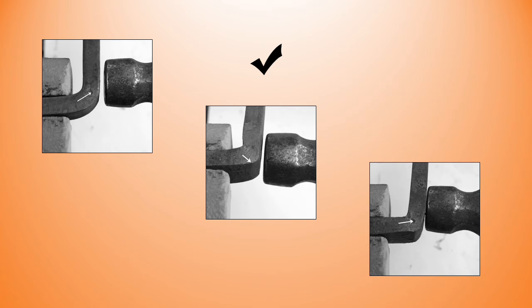The top left photo shows the center punch mark. To work on the other side of the corner, I need to turn the bar around in the vise, but that will put the center punch mark down. I won't be able to see it. But what I do have is a shadow mark, basically, of the end of the flat that I created earlier, as shown by the arrows here. I get close to matching the flats and then I turn the bar over again so that I can see the center punch mark.